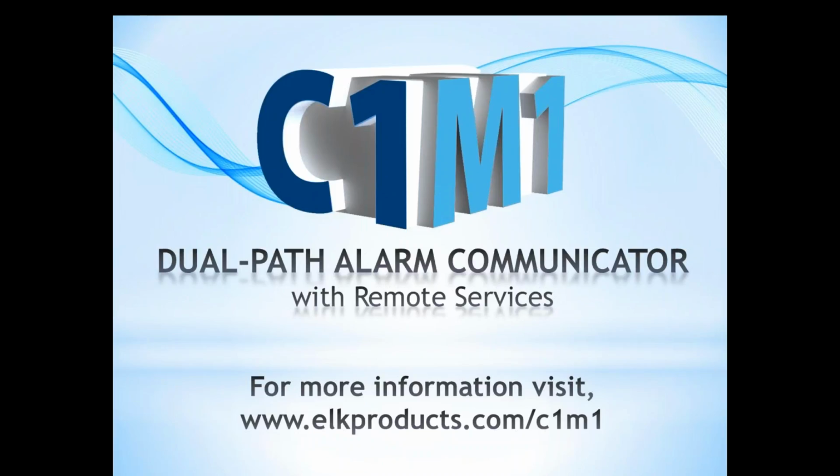As far as the C1M1 utility is concerned, you do have to be local with the USB to connect with that utility if you were to want to make a change, say, to the tamper setting, or need to do the discovery, that sort of thing.